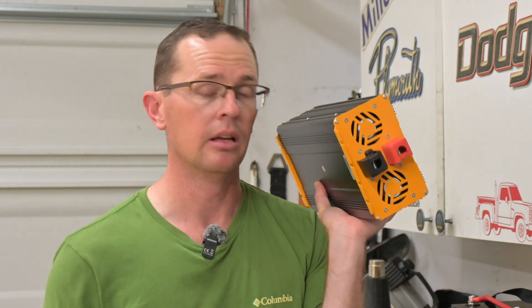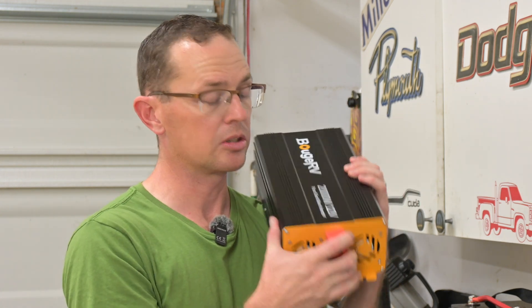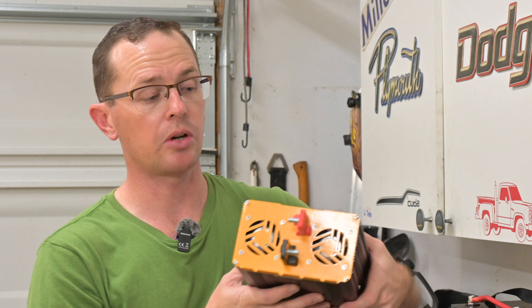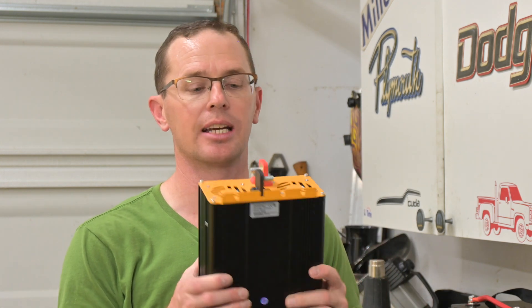On the other side, we've got cooling fans that are on demand. As you turn it on it's pretty much silent, and as you load it up and it gets hot, it will sense that and ramp up the cooling fans appropriately. We've also got our two hookups for the battery, positive and negative. What's super nice about this is the studs are opposing — so if you're trying to tighten up a connection, your wrench is less likely to cross and short out. Staggering lugs is a nice way to go and it really makes a big difference when you're designing a part to help operators use it appropriately.